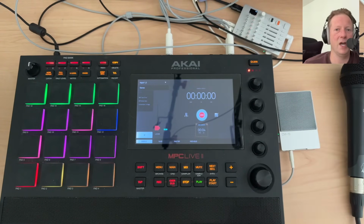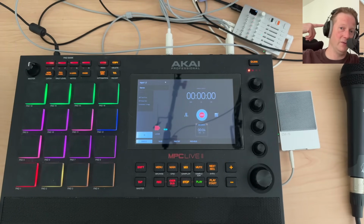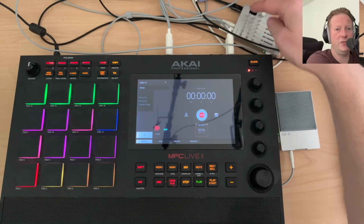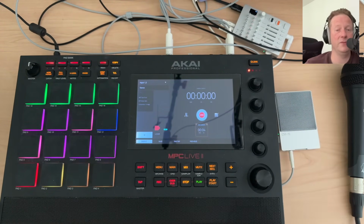Basically that Dig Dug DIY box is just allowing me to use a line level instead of microphone level to get it into the TX6. And it allows me to play the audio into my headphones so I can hear myself talking and get that microphone level in there. And then this all goes to my computer so that I can get it into OBS. So it's handling mixing all 6 channels potentially, if I have something on all 6 channels, plus the microphone is kind of a 7th free channel. And it works pretty well.